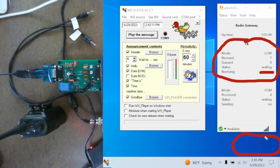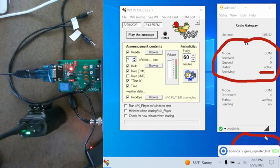If you do not get that, you have a setting wrong. This red light will only turn on when you have the settings more or less set correctly. The signal comes from the DB9 that turns that red light on — that's the only way it's going to turn on. It needs the signal from the DB9, so you've got to have everything set up correctly when it comes to the iPad or smartphone going over the two-way radio.